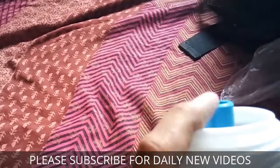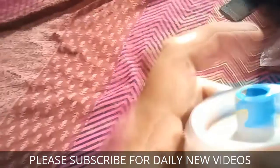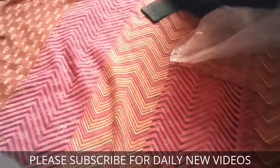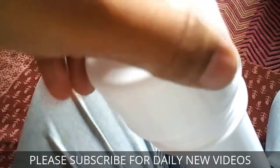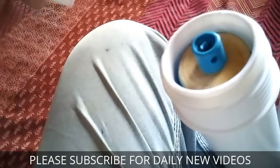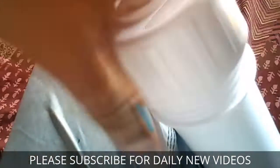Only a very nominal part of the membrane top should be visible outside — hardly half an inch or less. Then we have to take the cap and again make sure the washer is in place. If there is a chance of leakage, you can also put a white tape around the threads of the membrane housing to prevent leakage. After that, just put the cap in place.